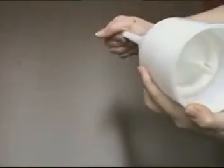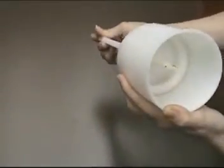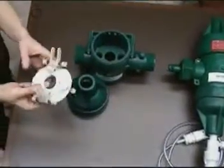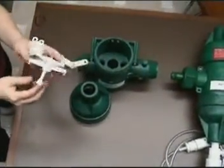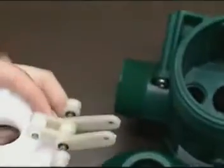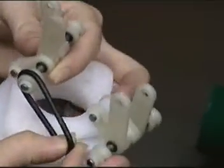The water flowing into the inlet is alternately directed by the intake exhaust valve module from the top to the bottom side of the motor driving piston, creating an up and down action. The valve module is activated by the tension bands to redirect the water flow at the top and bottom of each stroke of the piston. This redirection is the snapping sound that is heard when water is flowing. These tension spring bands are 50% heavier than on other medicators, and they run on roller bearings to reduce wear.